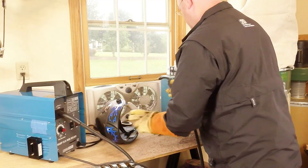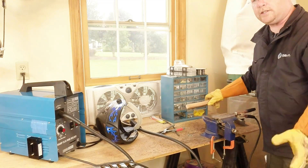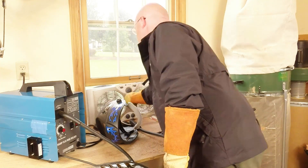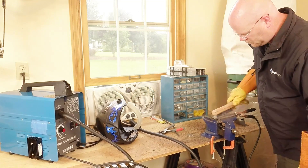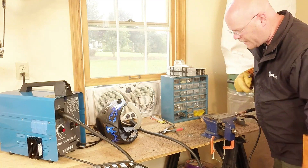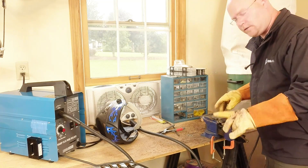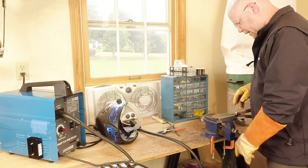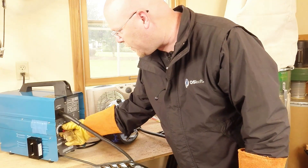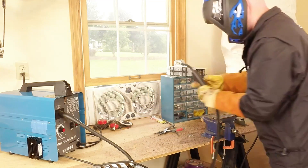Well, it didn't blow up. My bead is crooked and sitting on top of the metal because it's turned all the way down, but it had a decent coat of slag on it and it definitely made a whole lot fewer BBs. So I'm going to go ahead and turn this bad boy up to five and let's try again.